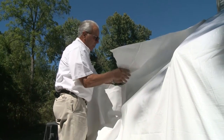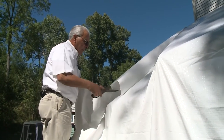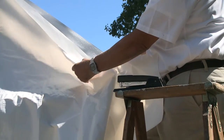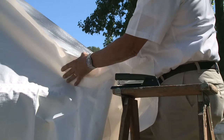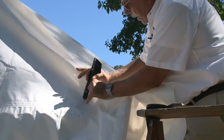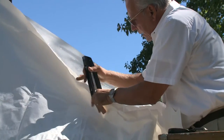We're going to trim off the excess material but leave enough — three or four inches past the cut — so we have something to tape to. Now that we've made the two cuts with a little excess material, we pull the material to where we want it and take a stapler to staple the material in place. This gives us our nice seam here.